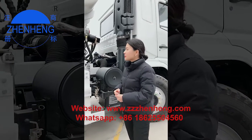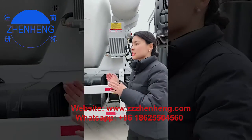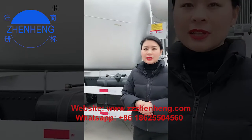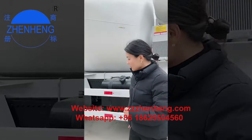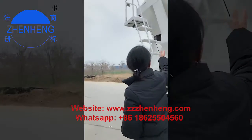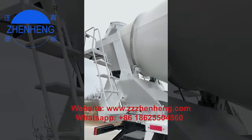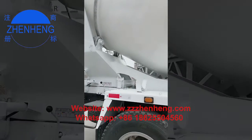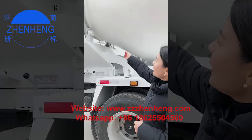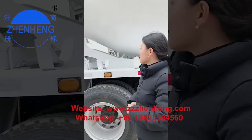This drum is made of very resistant steel alloy — wear-resistant steel — which extends the service life of the drum significantly. The space between the support roller and the guide wheel is controlled within 0.3mm to reduce the jacking value between the support roller and the guide wheel, which also extends the service life.